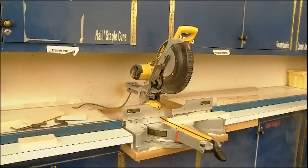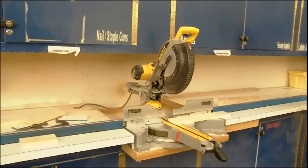You kind of have to see it to understand it, and you'll see it at some point in the not too distant future. But speeds and feeds are very important. Once you start working in the shop, in a very short period of time, you'll recognize how fast to feed a board into the table saw, how fast to move a board across the router bit on the router tables, how fast to push a board through the bandsaw, how fast to drill a hole in the material on a drill press.